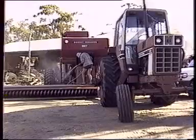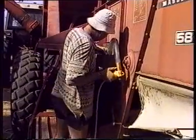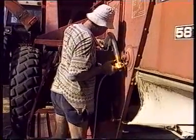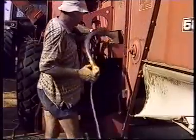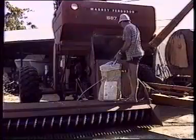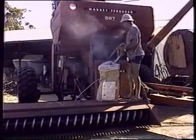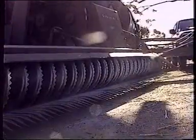Clean down and dust all grain handling equipment before laying it up at the end of the season. A blowvac Venturi gun, powered by compressed air, makes a good job of sucking straw and grain debris from the header. Then you can reverse the gun to blow the rest out. Next, blow inert dust throughout the machine using either a blowvac gun or a simple bellows duster.